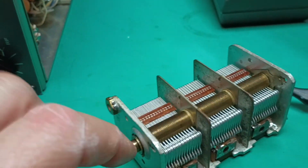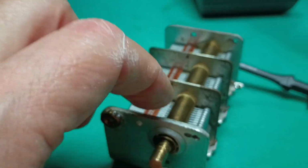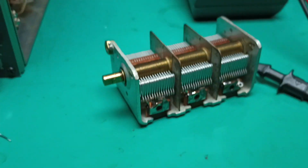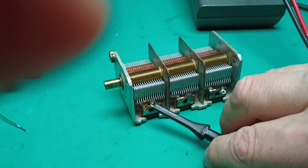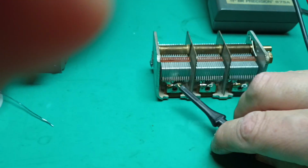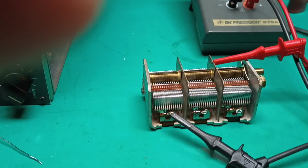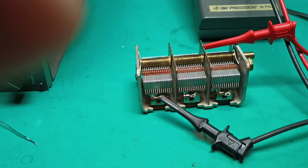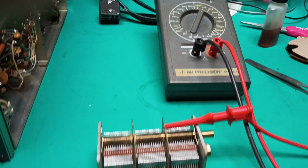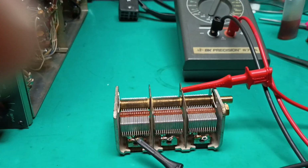So once that's done, it's got to be a new ground system put on the rotor shaft, because these old grounds are no longer any good. So once that's all done, then it's got to sit here overnight with the capacitor meter, set it there, let it sit overnight, don't touch it, because the one in the TR3 could just let it sit there, and suddenly, for no apparent reason, it would open up. The meter would suddenly go to overload. So there's how to save the radio, literally. That capacitor's gone, the radio's junk.